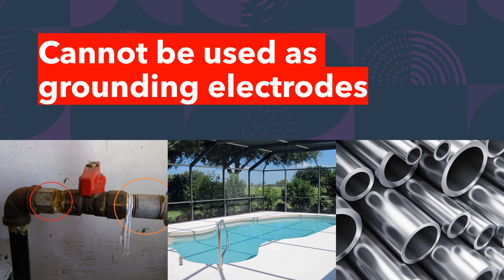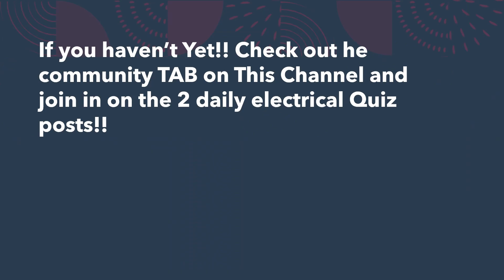With that being said, these are the three things you're not allowed to use as grounding electrodes: gas piping, anything aluminum, or any part of the equipotential bond that is part of the pool system. If you have any questions, just let me know. Always ask your local inspector about what you are and are not allowed to use in their jurisdiction. These are NEC rules and pretty well going to be across the board, but you can always ask for further explanation from your local inspector.